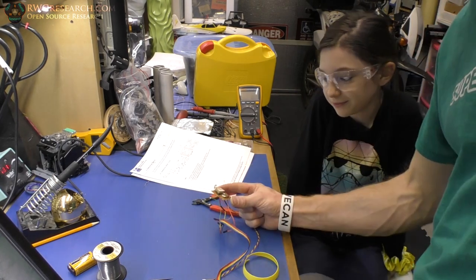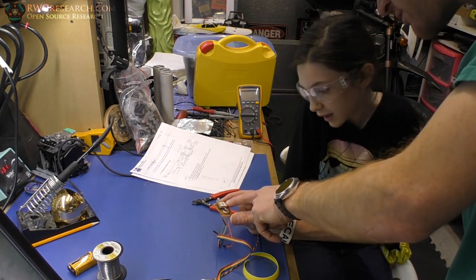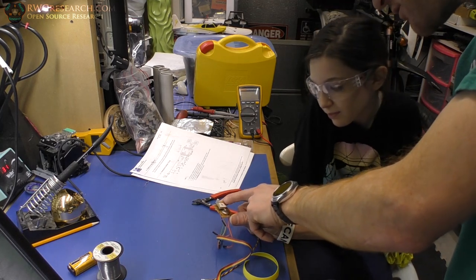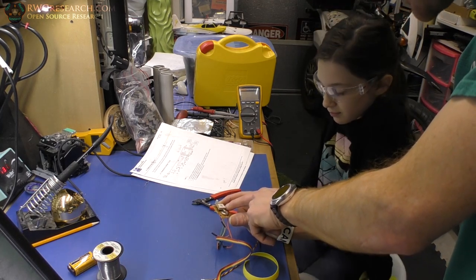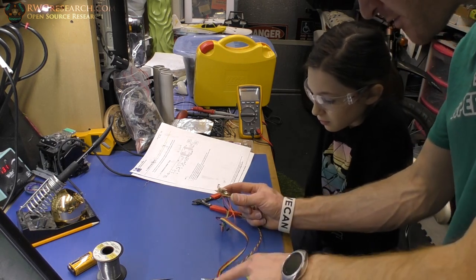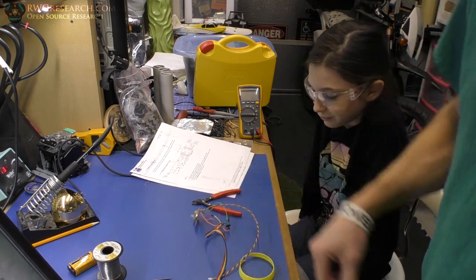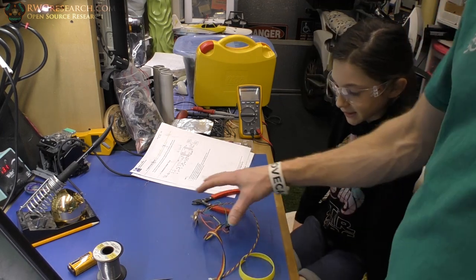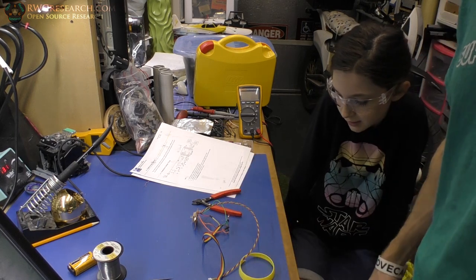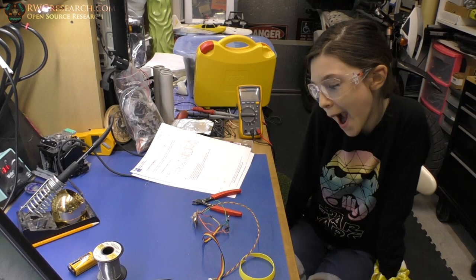This little chip has this antenna on the top. The chips are under the little silver tin thing that we soldered this wire to. Under this antenna is the actual stuff that does the GPS information, and it sends it out over serial, which is connected to this at the moment. So, anyway, we're going to unsolder this, hook it up to the BeagleBone, and go from there.